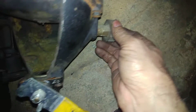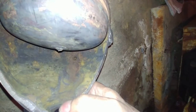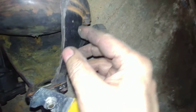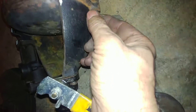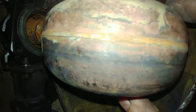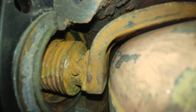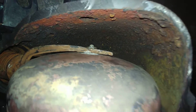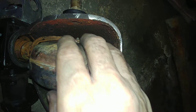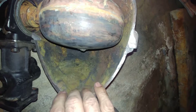This is the inside view of the bottom feed. You can see it's partially occluded — it's only a half inch. There's the separation between the top and the bottom; you can undo these bolts here. There's the bellows right there on the inside. You can see the top is fairly clean, but this is where a lot of the gooey, oil-laden rust likes to sit, and the sort of black rust here likes to sit.